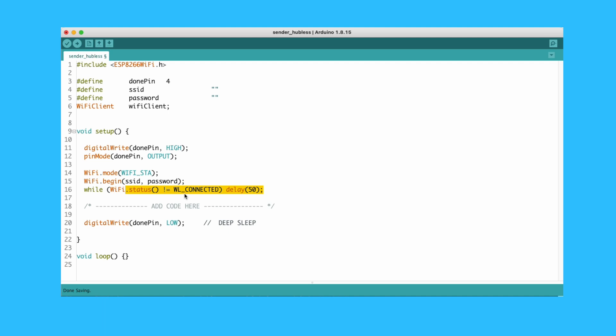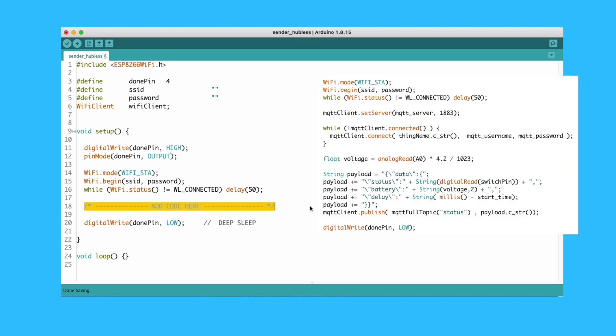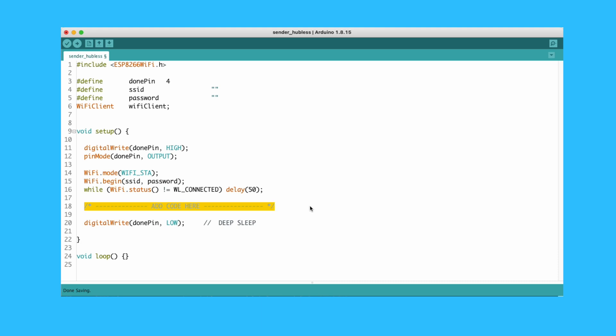When the sensor wakes up, it connects to the Wi-Fi, performs whatever it needs to do, and then at the end puts itself in deep sleep using this line — which signals the LDO to shut down. This block of code in the middle is what changes from one application to another. In the garage door I publish to an MQTT topic, and in the doorbell I use the Telegram API. That's really all it takes to use the contact or temperature sensor directly with Wi-Fi, bypassing the hub.